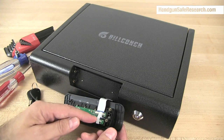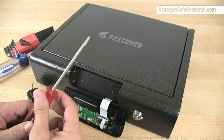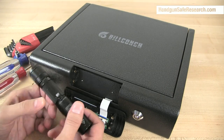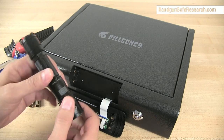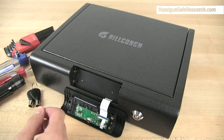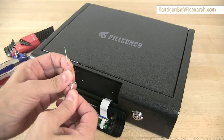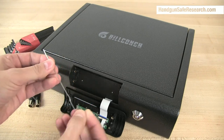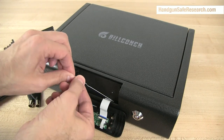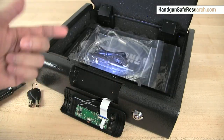You can see there are two brass pieces for screws to thread into, and honestly, I think that if someone attacked this and pried it off, the brass pieces would likely break free and the screws would remain captive and held in place. But I'm not really concerned about these holes. What I'm concerned about is this hole right here for the cable that's passing through — it's big enough that someone can attack the latching mechanism with a paperclip. It's open.